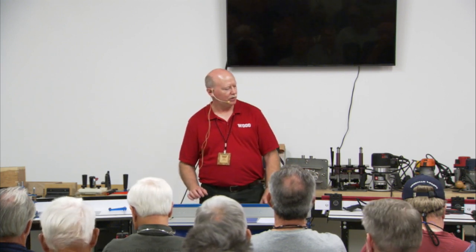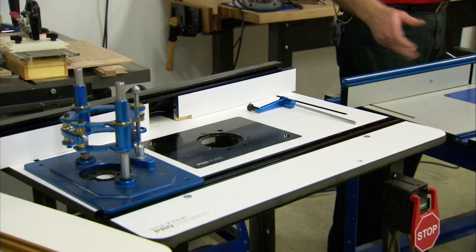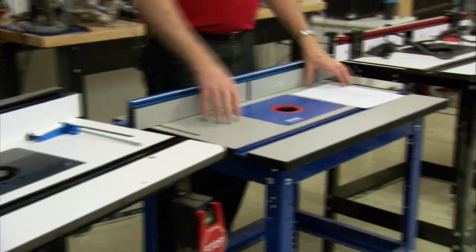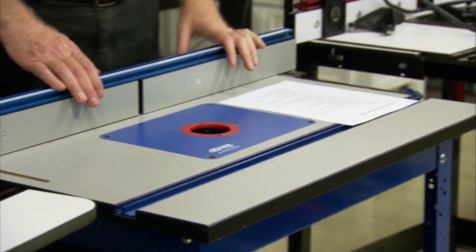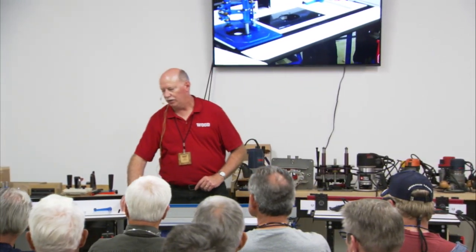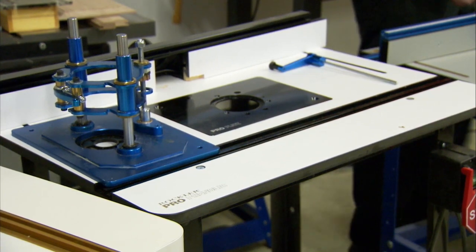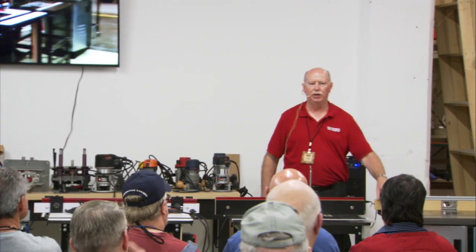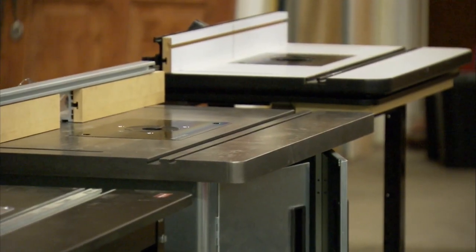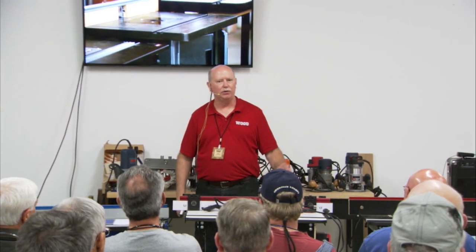A shaper is a great tool if you're doing a lot of the same setup — like raised panel doors or dovetails for lots of drawers — but for most purposes, shapers just aren't as popular as they were 25 to 30 years ago. With router tables, there are basically three kinds of tops available commercially. You have an MDF core with a laminate cover, which is on the Kreg table and the Rockler at the end. Then you have a phenolic table — a solid synthetic material — on the Woodpeckers, Jessem, and this Rockler table. The third option is a cast iron table, which we have on the Bench Dog, and Lee Valley also makes one.